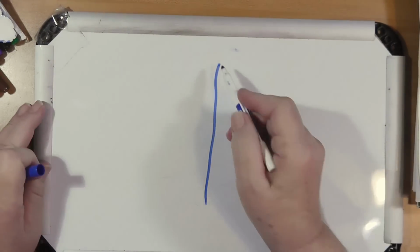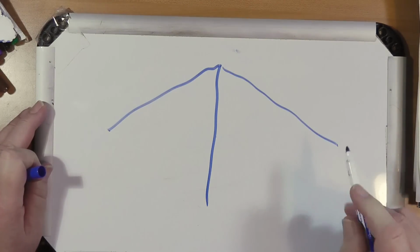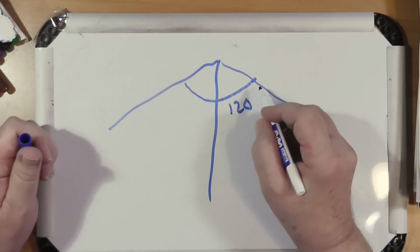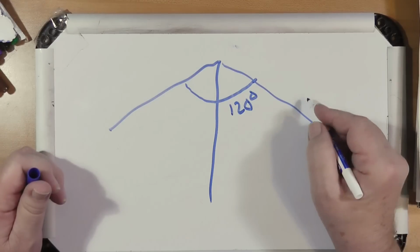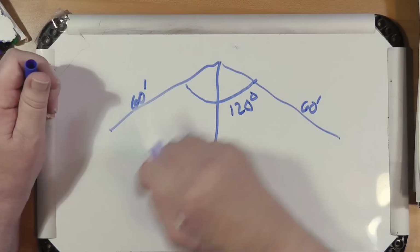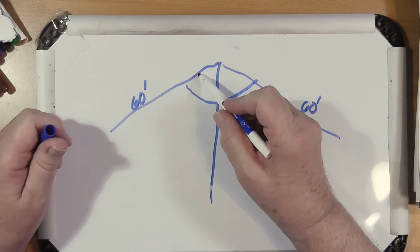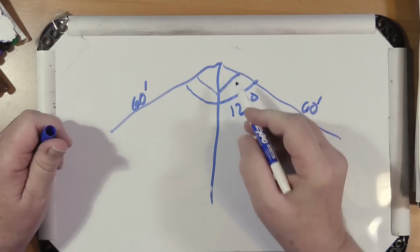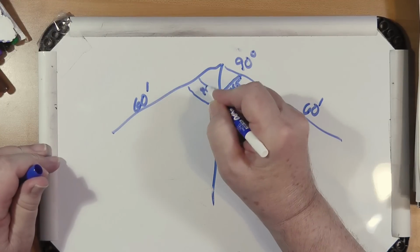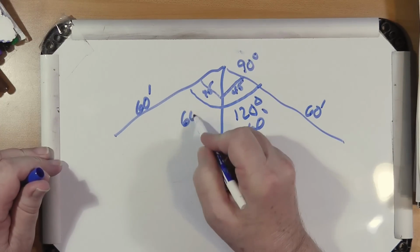So let's look at your classic inverted V. It has a central support and has the two halves of the dipole coming off like this, and this central angle right here, ideally, is 120 degrees. This has nothing to do with feet, okay? It's a coincidence that the length on 75 meters is 60 feet on the side, or 120 feet total, but 120 degrees. Certainly, if you want it to perform well, you want it to be at least 90 degrees. So this would be 45 on a side, when ideally it would be 60 degrees on a side.